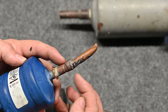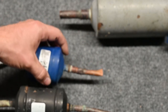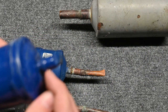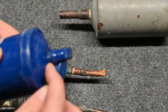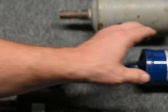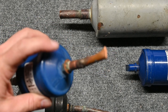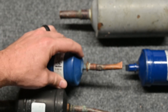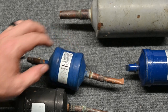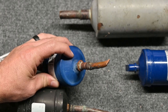This particular manufacturer also leaves us a nice long stem right here, so we have plenty of room to get our torch to pull the brazing rod up into this connection. Some manufacturers leave a very small connection, so we have to get our flame really close to the paint to get the brazing rod to pull up into the connection. When possible, put it inside and protect with a rag. Worst case scenario, maybe you should add some paint to it. I worked with a guy that always repainted his filter dryers after he was done working with them.